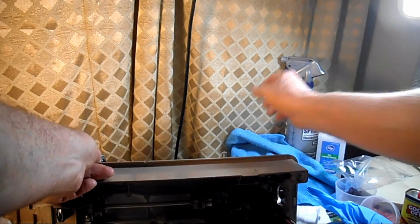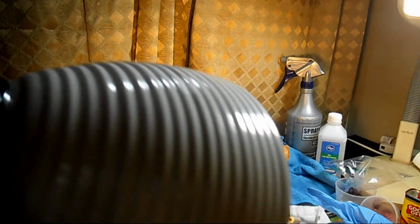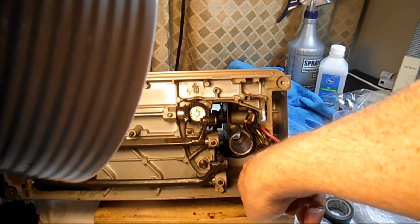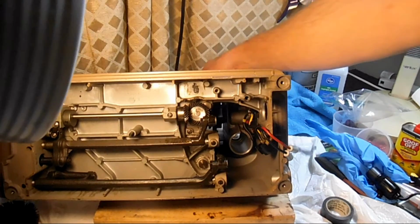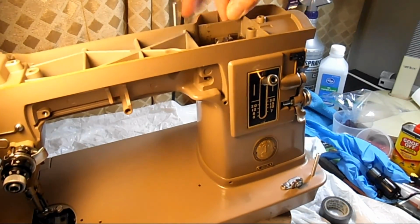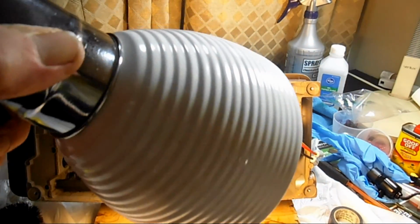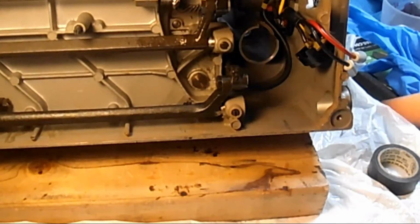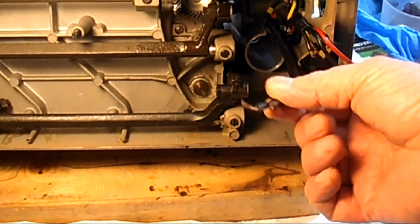And then down here, I showed you the picture down here where that wire comes down the channel, and it loops under the motor holding tube to go up to the terminal on the side. So I kind of pulled up the slack. Before I laid it back, I should have pushed the wire down in there a little bit with my finger. But then you're just going to pull it. Let me zoom in here. You're just going to pull that loop that goes under the motor, and it'll pull down from the top.